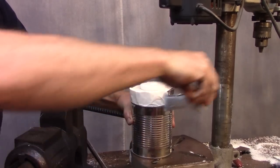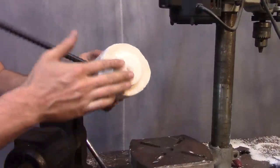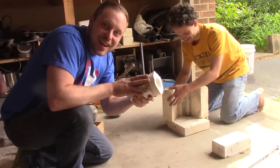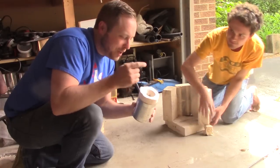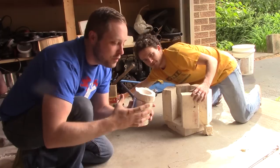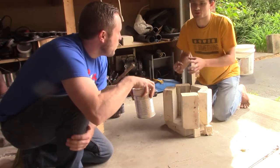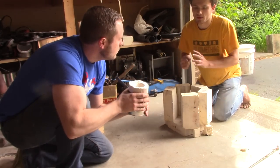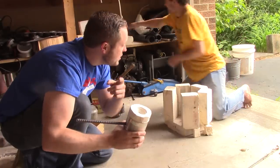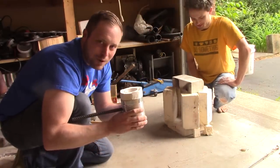After a bunch of waiting my plaster is done. Now it's time to throw this thing in the oven and let the wax melt out. So now I'm in Pittsburgh with MakerJ101 and I didn't do this correctly — I'm missing a step. You have to cook the water off; you have to break that bond and get the water molecules out. You have to bring it up to the temperature that the molten metal is going to be poured in at, so that the moisture doesn't bubble up through the metal and leave it all porous like foam. So he's going to help me out by setting up this makeshift kiln to cook it so it actually works when we go to pour the metal.